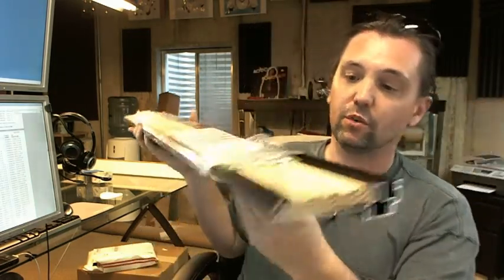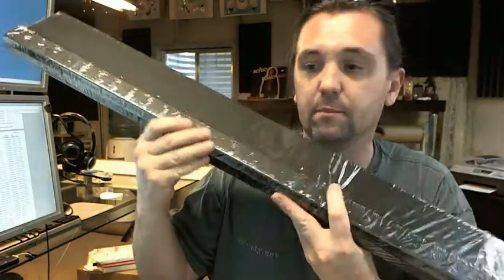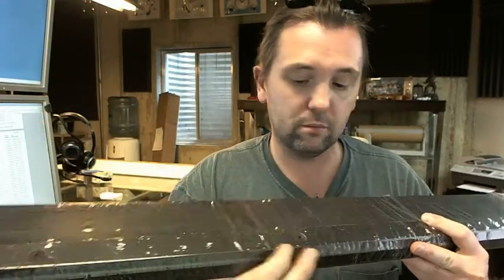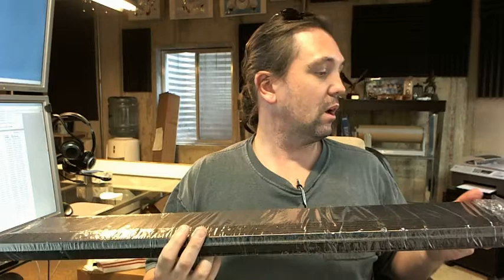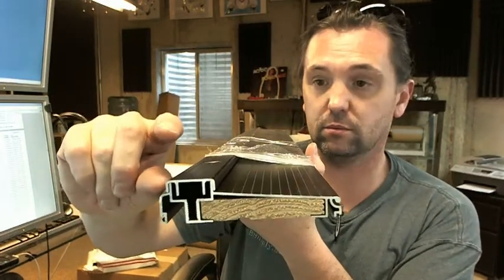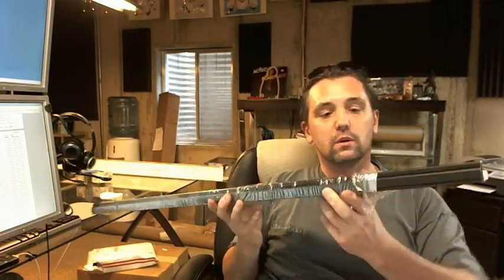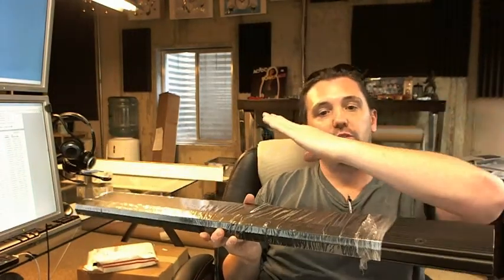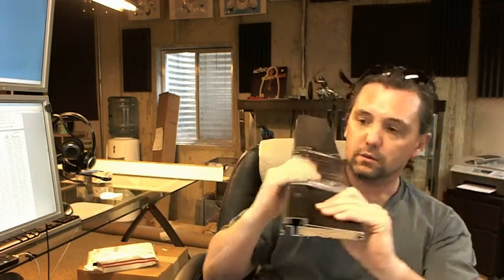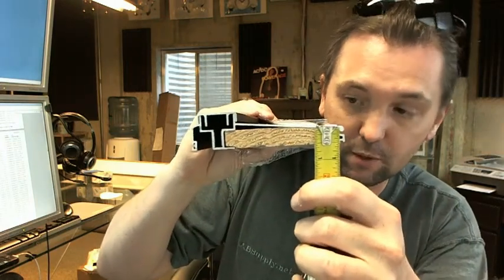You can turn that up — there are other adjusting screws, you can somewhat see them. You can adjust that up to inch and three eighths. That's nice because you can tailor the threshold to an uneven floor surface within a quarter inch. In the front, we are at half inch, which is very typical.